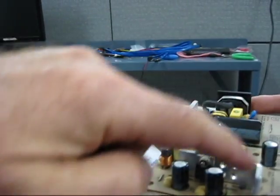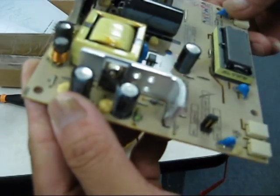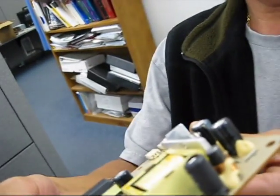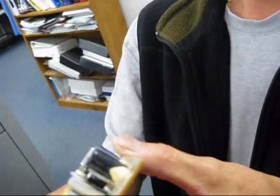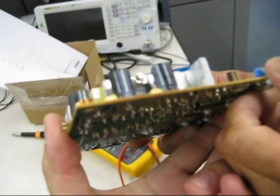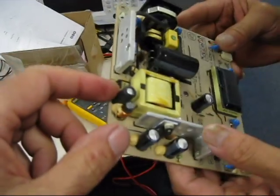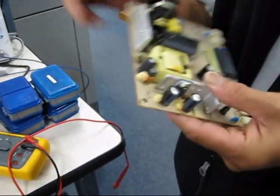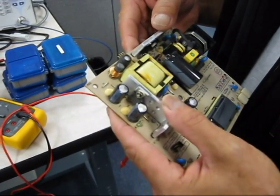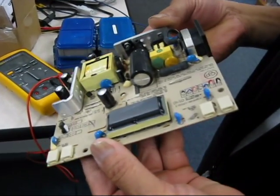As a comparison, this one here is nice and flat, whereas these four capacitors are bulged up. These are 470 microfarad — and this one is covered up so we need to check — but the voltage is 25 volts. So 470 microfarad, 25 volt. We're going to replace these, and my hunch was correct: it's a capacitor issue on the input power supply board.